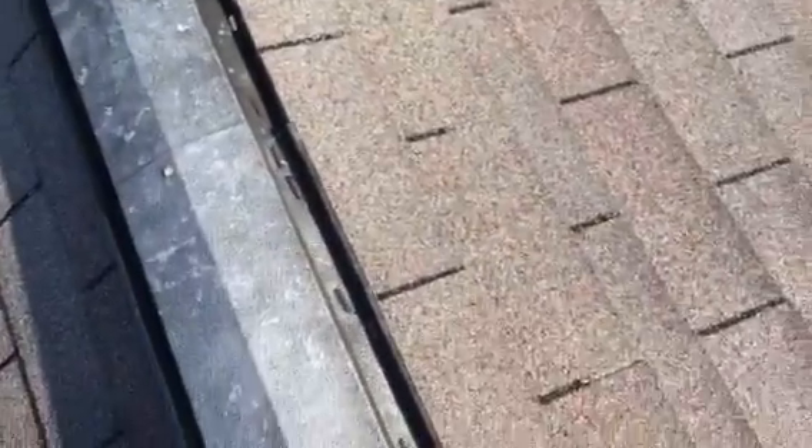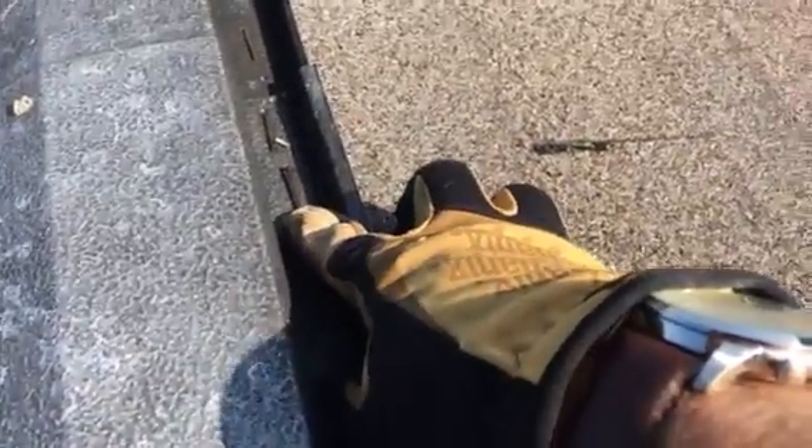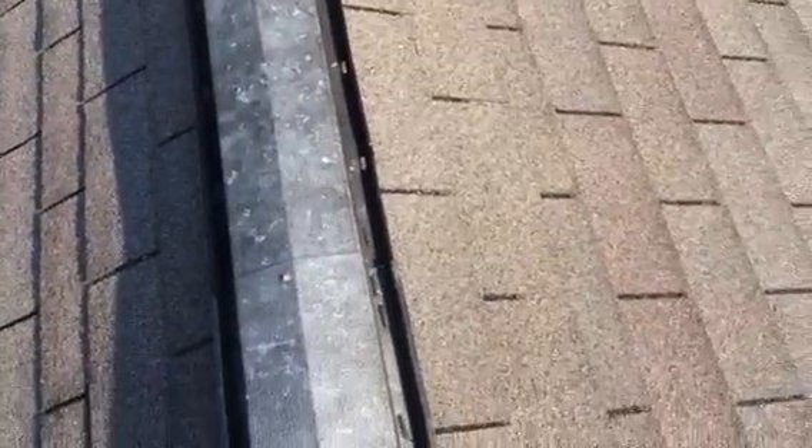You can tell that they stapled the roof. This is one of the reasons I'm not a big fan of the aluminum ridge vent right here. You can see this leads directly down into your attic space, and this is how water is supposed to be funneled out through these channels or weep holes. If you have water rushing past this, it's running right past that staple that's already working its way back out, and that has a high potential for water intrusion there as well.